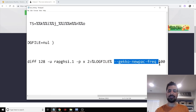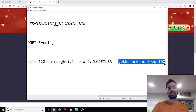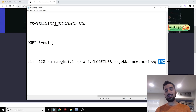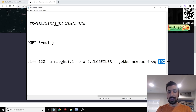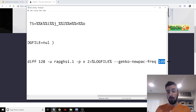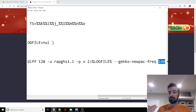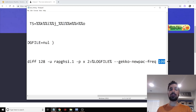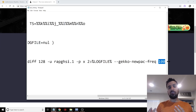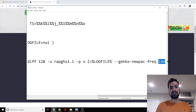The next step is to add a frequency — you can edit the frequency yourself, which is cool. Just add this little line in the file, also listed in the description. 100 MHz is the standard. It can go higher, like 200-300, but remember there's no active cooling on this — just a little metal heatsink, no fan. It will overheat. Even in a hot room at stock clock speed it might overheat. Cooling is always recommended. Running one at stock speed with no cooling may be okay, but if you're running multiple or overclocking, you're going to need some fan attached.